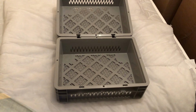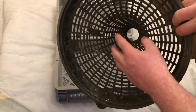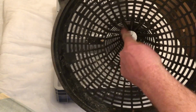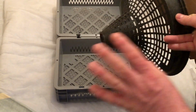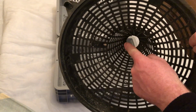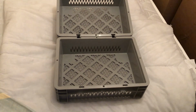And another thing here is we get a lot of weed, because the problem with them round pots is you've got a funnel each end, and as the tide is pushing towards it, that blocks these holes up. One fisherman used them around here and all he did was keep blocking the entrances up all the time. Well, I don't want that, because obviously these have got one on the front and one on the back opposing each other with a tube in between. I don't want the tide going on there, because that's just going to push weed straight in that eye, and as the tide changes, push weed in the other eye. So I don't want that. I want the eyes on the side.